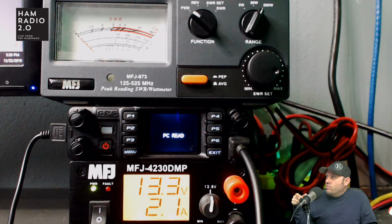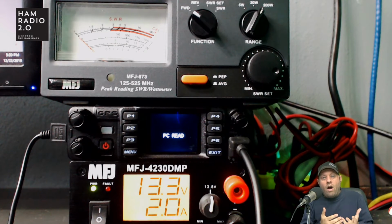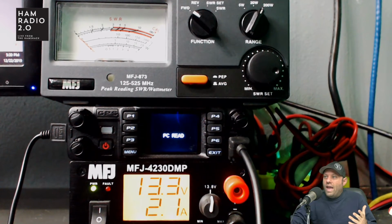So right now it's writing those 149,300 some odd contacts to the memory in the radio, so that when you turn your radio to a local repeater or a hotspot or whatever you listen to DMR on, and someone's talking, you'll see that person's name and call sign. That is what this is going to allow you to do. And it does take a few minutes just because it's so large.